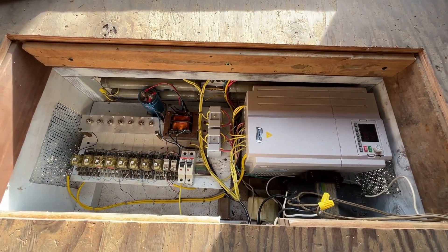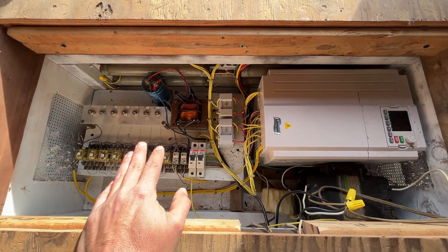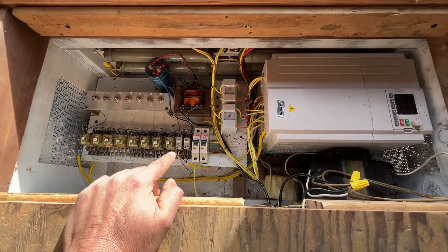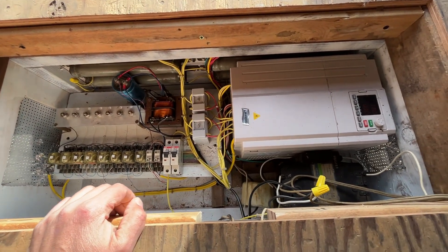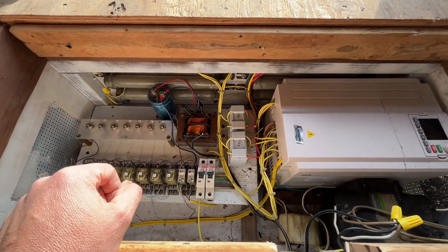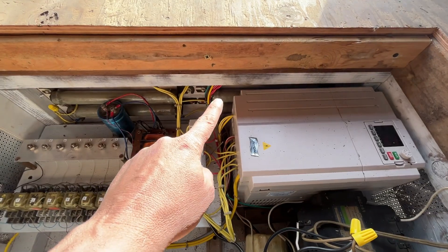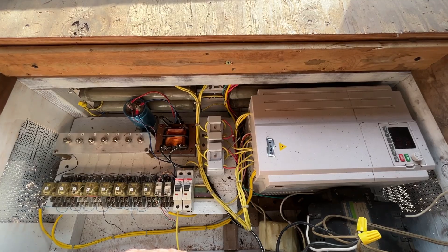Because the VFD does have a fan that blows out, it's got ventilation. Looking at the equipment in here, this is the control panel that you saw in the last video — I've got it all mounted down in there. We've got our relays for the throttle notches, the forward/reverse, a couple of circuit breakers to protect the transformer and the incoming power. We've got potentiometers for adjusting the speed, and these are current transducers that monitor the current to each traction motor.